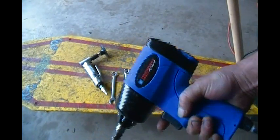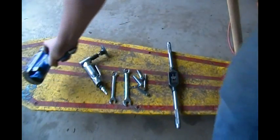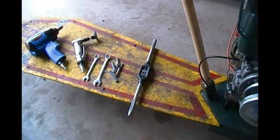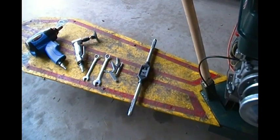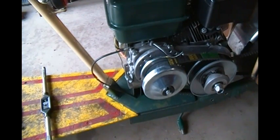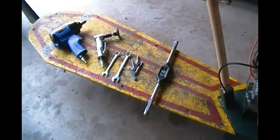As Swabster said, I took my impact driver and gave it a couple quick blasts after I screwed it in finger tight, put a wrench on it and tightened it somewhat, then gave it two or three little blasts with the impact driver. I secured a bolt 8 millimeter by 1.25 thread pitch, two and a quarter inches long. I put a lock washer on it — I didn't use lock tight — and used the impact gun to set it. Should be good to go, so that's how you do that.